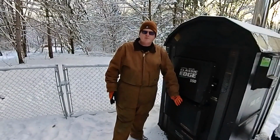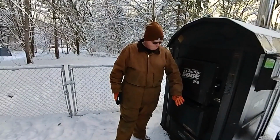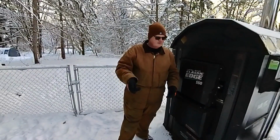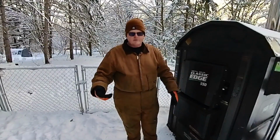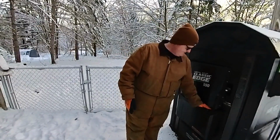So I'll show you where the primary elbow is. I'll show you how to pull it off, and then we'll pull it out and see what's in there. If there's tar in there, we're literally going to have to get in there and scrape it out. And then usually what I do with it, maybe good, maybe bad, I just open the boiler up, throw it in there, let it reburn it. It seems to get rid of it. So